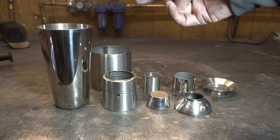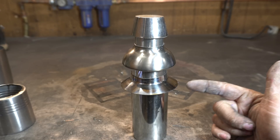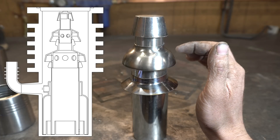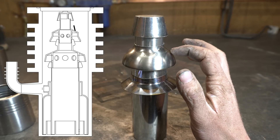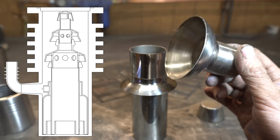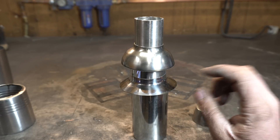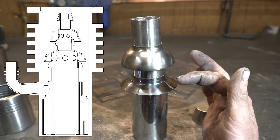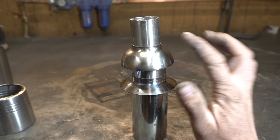As you can see, I've sorted through, cut, cleaned, and deburred all the parts that I'm going to need for this thing. What you see here is the pump minus the outlet. This is how the stack is going to go together. I wanted to try and copy the geometry on the plan a little better. It's difficult when you're making it out of cocktail shakers, but similar to the plan, this guy is going to be shooting just a little bit off of the edge of this guy, and this guy is shooting right down on top of this guy. On the inside of these jets, there's just holes drilled around it — it'll make it much easier to match precipitation rate all around the radius. So let's get some holes drilled in these guys.